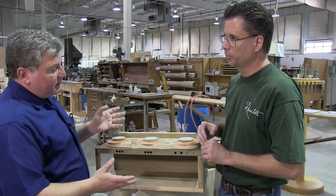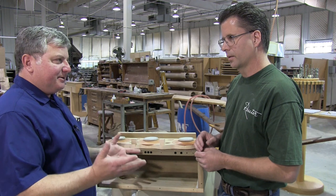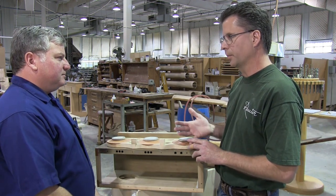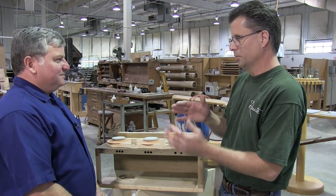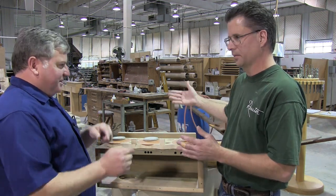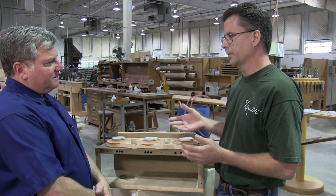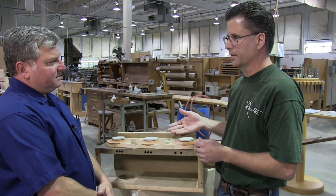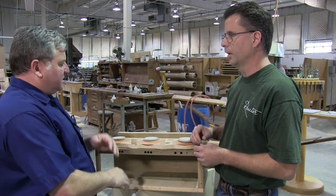So besides this style of chest, you make other types? Right. Electromechanical or things like that? Right. Our pitman chest is our other big chest that we make. The advantage to the pitman chest is you can have multiple ranks of pipes on one set of switching, so you only have to buy one set of magnets, and you can run 8 or 10 sets of pipes off of them. So we build those quite a bit. The unit chests are flexible, you can play them with more than one pitch from more than one division.